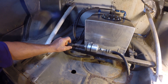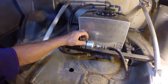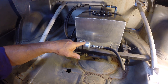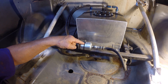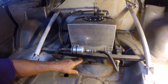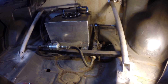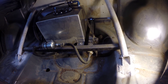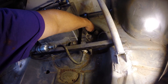There are quick connect fittings here which I'll get into later. We have the fuel filter on here — if you have an eagle eye, you'll notice this fuel filter is actually backwards. My stepsons were helping and I wasn't paying attention, so it got installed backwards. I did actually run the car like that and it seemed fine, but I am going to get another one and turn it around. The fuel goes through here and down into the pump — this is a generic pump, about $90 to $100 from the auto supply store.